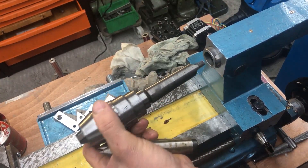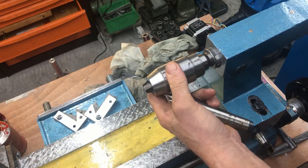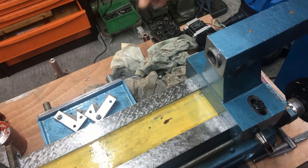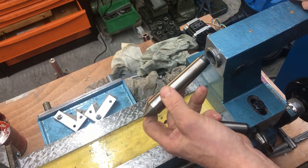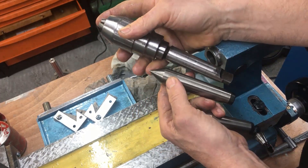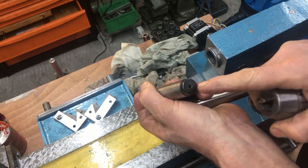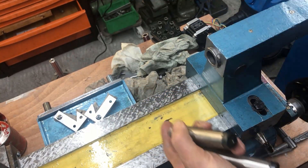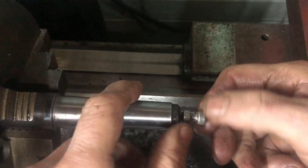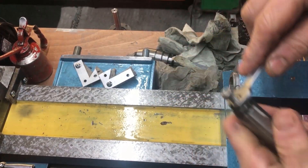Curiously enough, I find that this MT3 fitting will be thrown out — disengaged by the screw inside. But if I use a center like this, it will not enter to the same depth. So I need to introduce some kind of modification to the centers to be able to use them — a very simple modification, just adjusting the length.